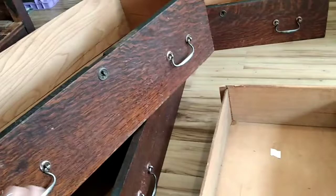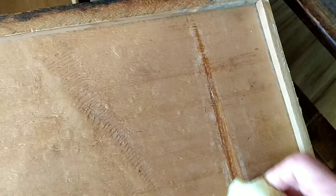The last order of business is to put back the drawers. This is a clump of beeswax, and I'm just going to run down these runners like a sleigh, and same thing inside here in that groove — just make sure this is well lubricated with beeswax. I'm going to do this to all of the areas making friction with those drawers.